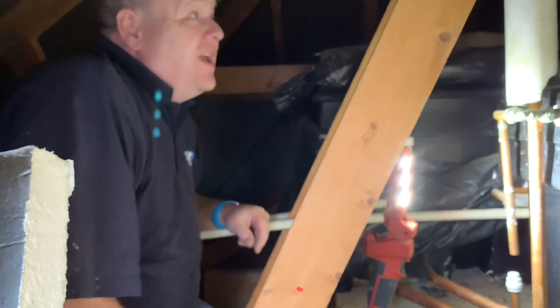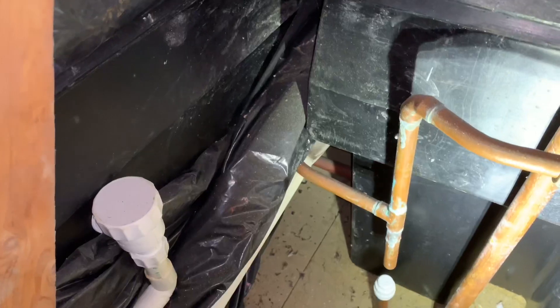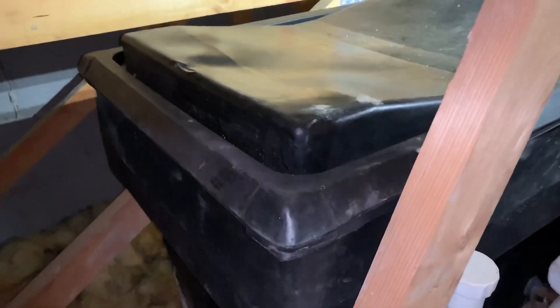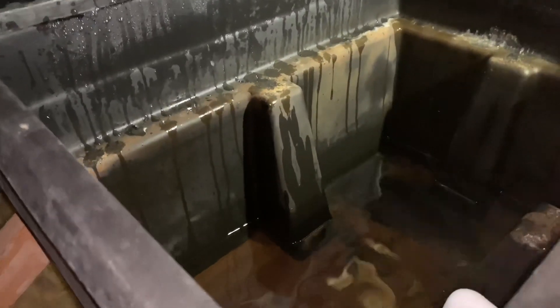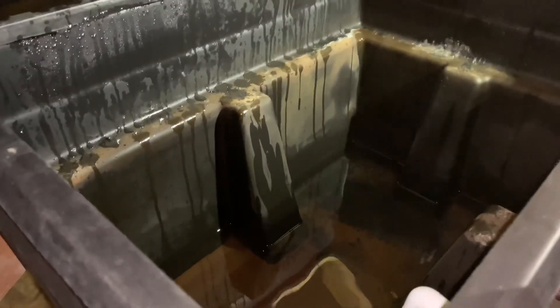We're in — it wasn't too bad actually. We'll cut some of these pipes out now. It's good to show you in here even though it's tight. There's a small tank at the back — we know that's for the heating. Then we've got two big tanks. I need to make sure they're fully drained first. I've removed the lagging off the top of this one — even though it's drained down there's still some water in there, so we need to find a way of getting that out.